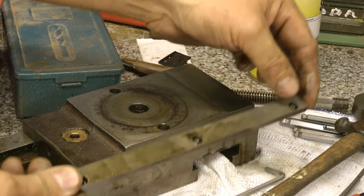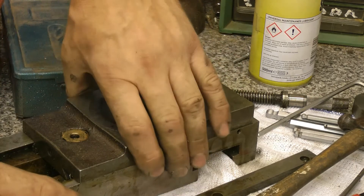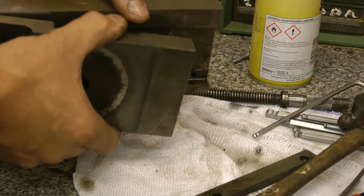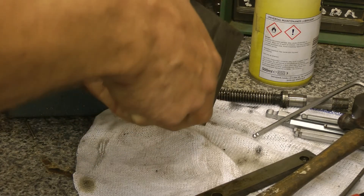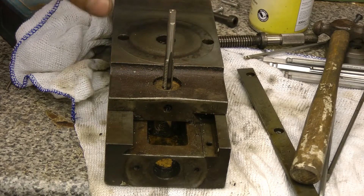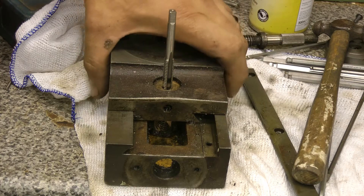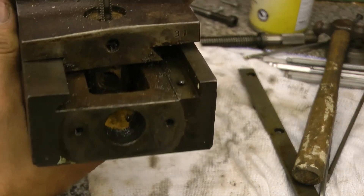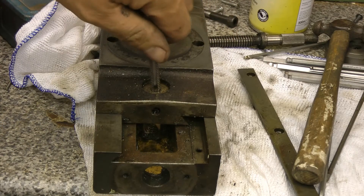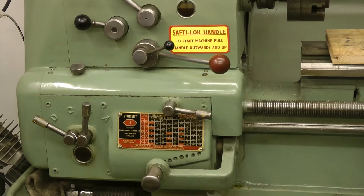I best keep it orientated the right way — I don't want to mess these things up. Leave that there. Now this should come off, or at least lift up, I imagine. It's still being troublesome — it's not giving up yet, even after removing the gib or jib strip. It won't release. We need to rotate that brass nut in there. Luckily the engineers at Colchester have thought about that, and it looks like it's a 5/16th Whitworth — interestingly, the exact same thread I found on that red handle there. So they must use some common threads when they were building it.